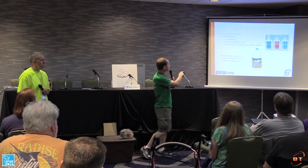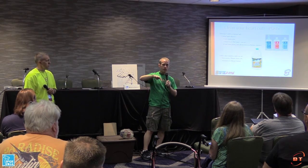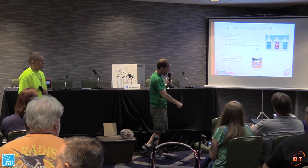And I'll take a little plastic container. I'll fill it. I'll drop all my plastic in it. All my posts, whatever I need to clean, I'll cover it, a good inch or two over with Mean Green, and I'll just let it sit for several days. And all that rubber residue, all the crud, any caked in wax, it'll clean it out. And honestly, what I started doing is I'll set it on the dryer, so when the dryer runs, it'll agitate it. Or I'll set it over on the AC unit, so when the AC runs, it agitates it, and I just forget about it for a couple days. And when I'm ready to take it out, I'll pour all the Mean Green out, I'll pour water, shake it, I just rinse it a few times and lay it all out on a towel, and then assemble it.